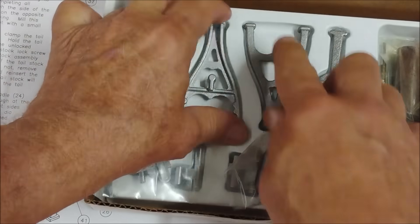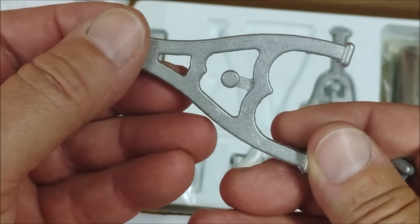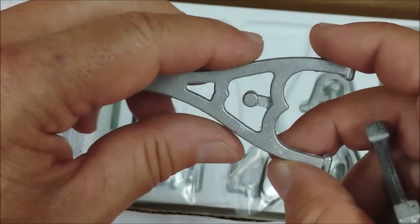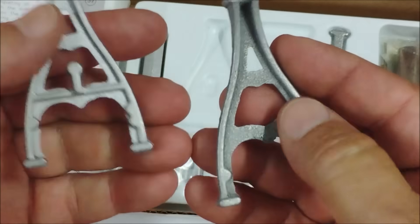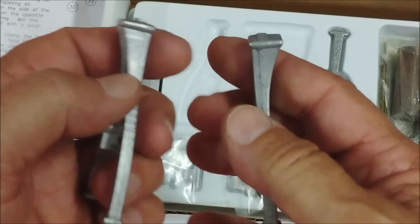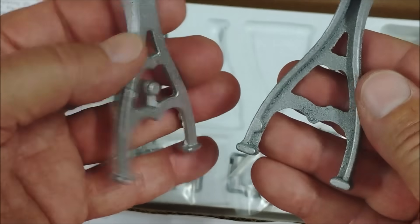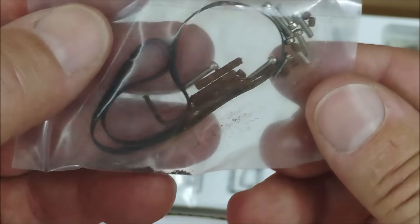I'll take a little closer look at the quality of these things. It was a very clean casting. It would appear that the upper and lower halves were probably very well aligned when they shot this one. And there is a definite difference in the gloss on these — I have to think they were probably all dumped into one big bin and pulled out at different times. Like this one might have gone through a wheel system and this one never saw the wheel abrator or deburring balls or whatever they used. But I'll blast them both when I'm done hitting them with the file. All the little commercial items they give you — just a bunch of screws.